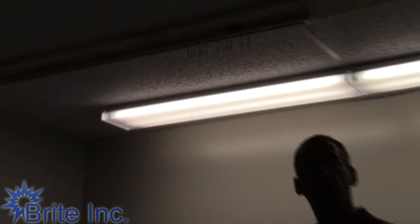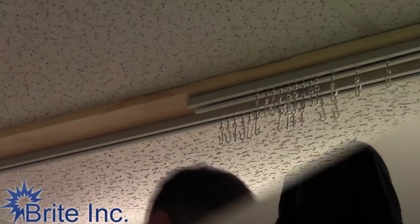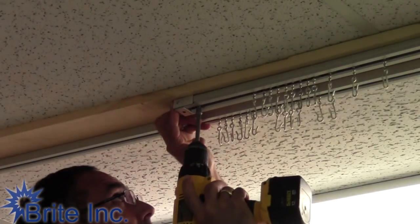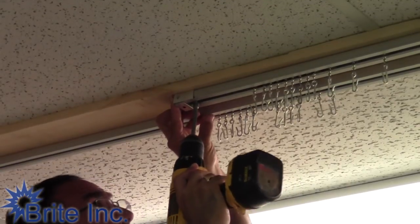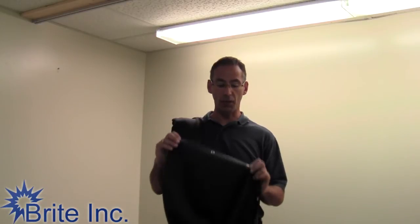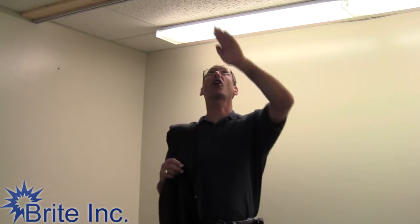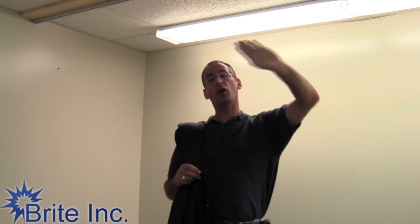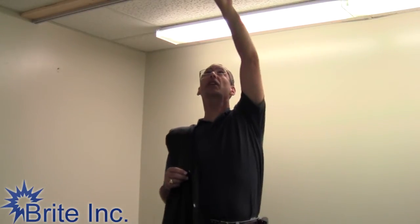I'm going to put the other track up and then hang the curtain. The track is all installed and carriers are hung. Rule of thumb: put the seam on the inside and start working towards the cap. So if the cap is on the outside, work towards the outside — that way if you put on too many or too few carriers, you can add them at the end.